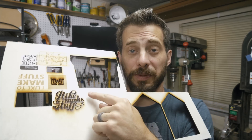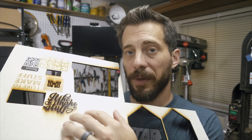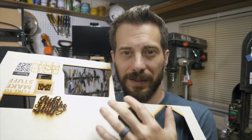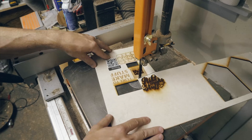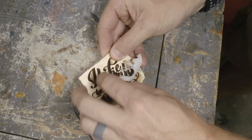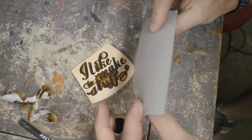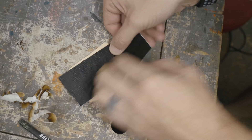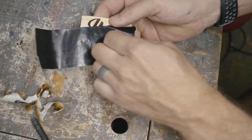That engraving on the darkest preset took about nine minutes to do. I didn't put any cut lines in so I'm just going to chop this out manually. One thing to point out: on top of their proof grade materials there's a layer of really thin tape, almost like masking tape, that protects the surface. When you make engravings and cuts there's a lot of burnout on the top surface, but since it's on top of this tape you can just peel it away. If you're using non-proof grade material you can lay down masking tape or blue painter's tape and it works just as well. To remove all the small bits on the inside, use a piece of Gorilla tape — press it down, pull it away, and it takes a lot of that stuff with it.